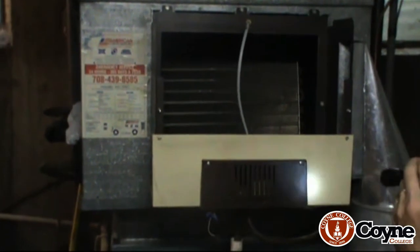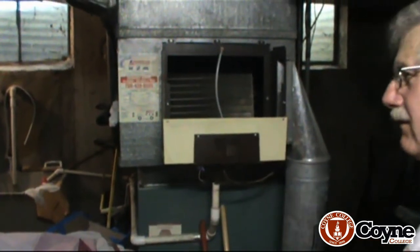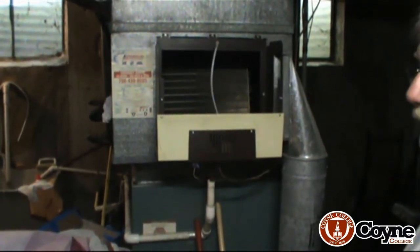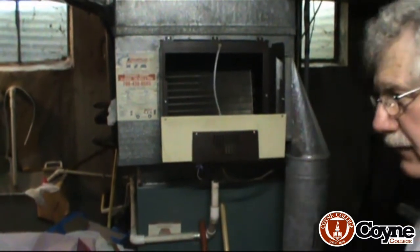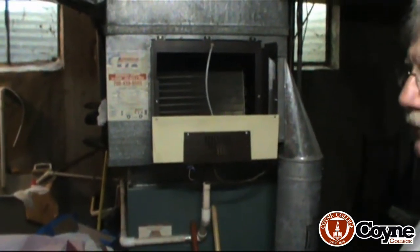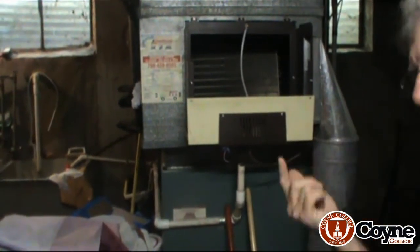Now, why do I start here? I went outside — it's a Trane unit. Older Tranes, this one is over 25 years old, and when it's that old, usually — not all the time — the evaporator develops a leak. Those U-tubes at the end of the evaporator: we're asking the refrigerant to fly around the elbow.